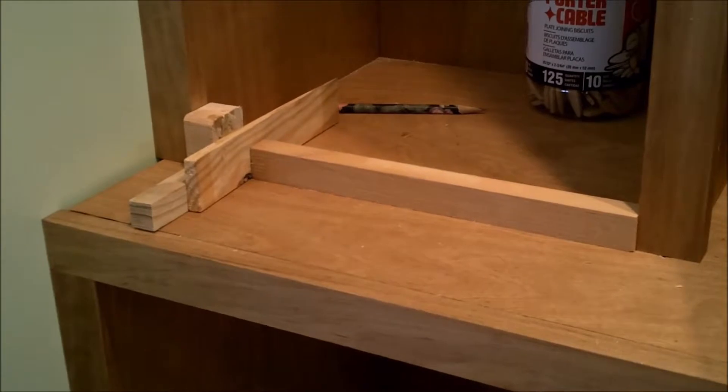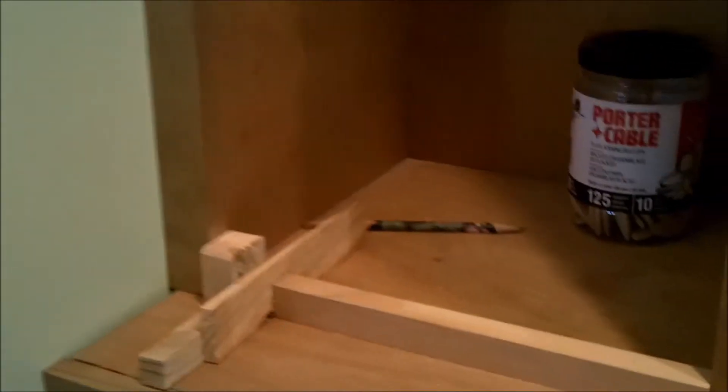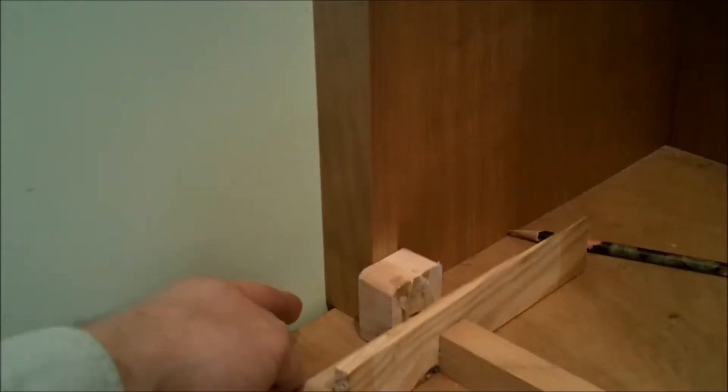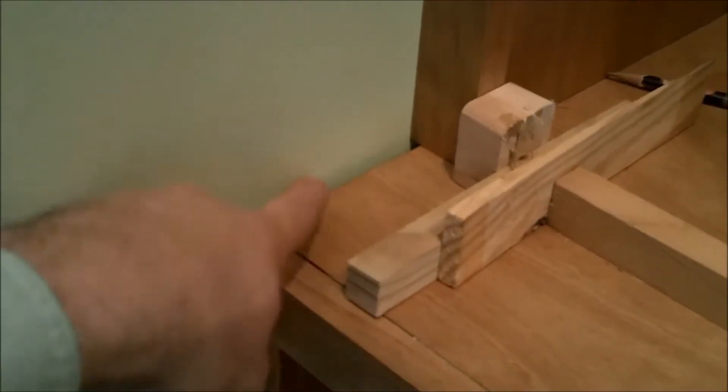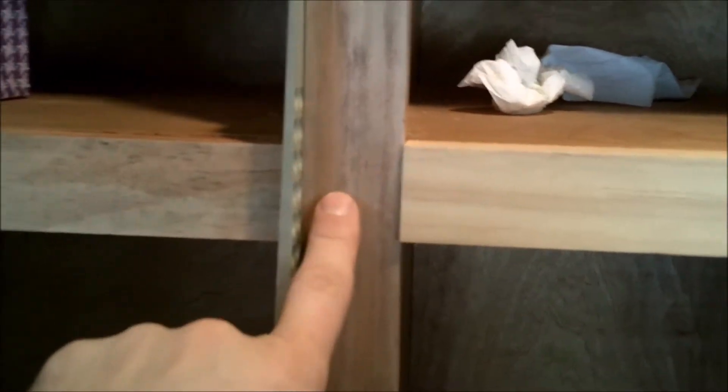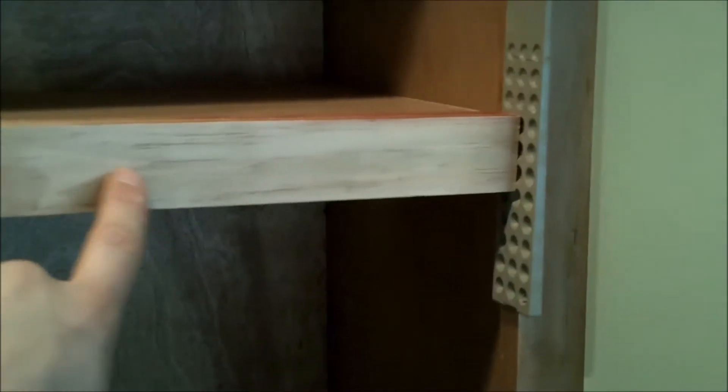Okay, finishing touches. I'm very pleased about this vertical. It's nicely pinched in there so I don't need any clamping to hold it and that glue will dry and hold it just fine. And I'm actually kind of proud of this section right here where I'm doing another vertical and I decided just to pinch it with some scrap wood and a shim so I get a nice pressure on that. It's nice and close against the wall. I'm going to have to figure out what to do about that gap — maybe I'll get permission to put some cord around there, or something blockish so it has the same style that covers up that mistake. And I've got something shimmed over to this vertical which is already installed, but to brace it I put a temporary horizontal in there and there and there, and this one here is pushing against the other side right now and that's gluing right there so I'm really close.